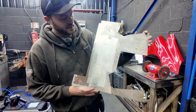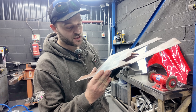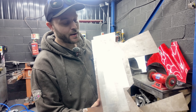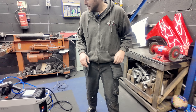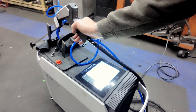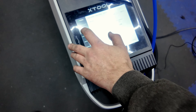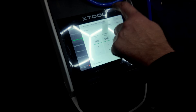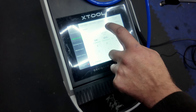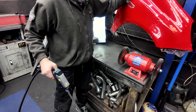Here is a piece of plate from the previous episodes — that was us doing rust removal. As you can see, absolutely savage: takes the rust straight off, straight back to clean bare metal, which is exactly what you want if you want to weld some metal. So we're going to set the welder up for clean. I've already got it on clean — you've got seam welding, pulse welding. I'm on advanced mode at the moment because I want 100% laser power for this. We're on clean, 100% power, scan width set to 10 millimeters, scan frequency set to 100.